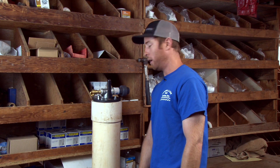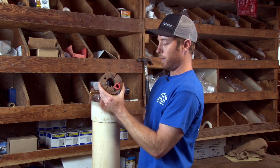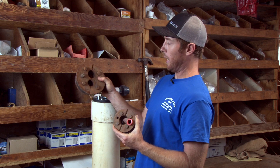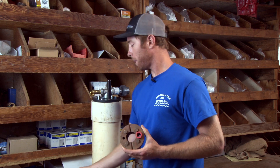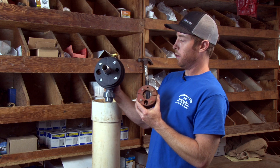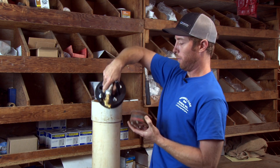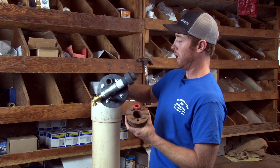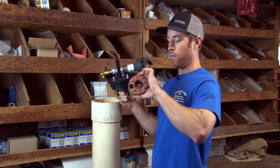What prompted this video is if you have a metal well seal. We have some old well seals here. This one is for an old four-inch well that has one hole in it. This one is for a six-inch well that has two larger holes in it — this would be for a well that had a jet pump installed. The point I'm getting at is these metal ones are obviously different. The plastic one is one solid piece on the bottom; the metal ones have two pieces on the bottom. The plastic ones have the nuts on top with the head of the bolt sticking in the bottom, whereas the metal ones have the head of the bolt on top with no nuts on the bottom.